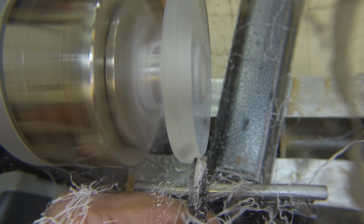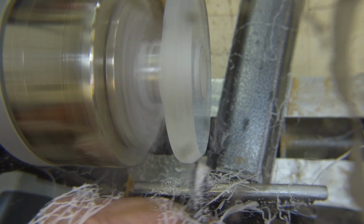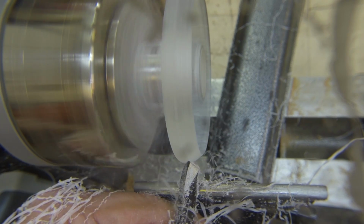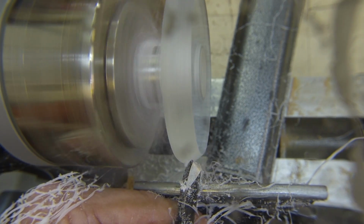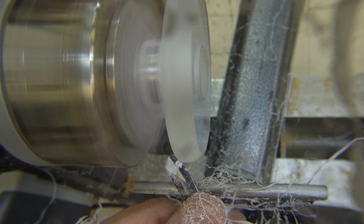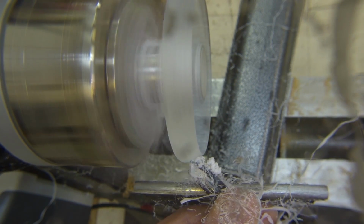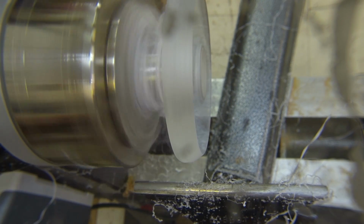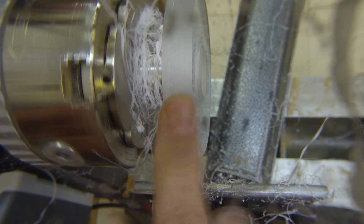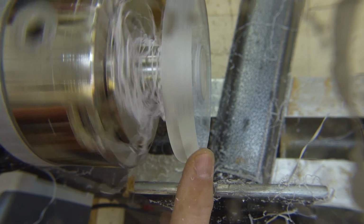So we're going to do a shape right here. Do some pull cuts. We're going to make more of a reveal on this edge. See what I can do here to blend that in. You're not going to sand this, so you want to leave the tool finish on here. And the thing about the tool finish is it's opaque. So you can see we have some opaque. I got a couple chips in there, so I'm going to clean this up just a little bit more. I haven't finished cutting away some of the bandsaw marks.